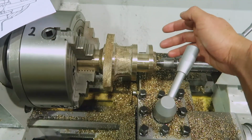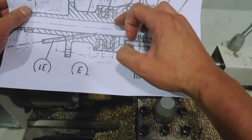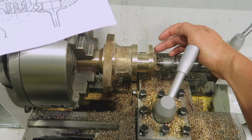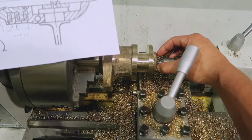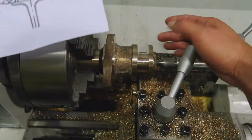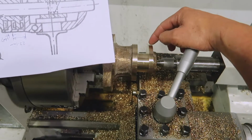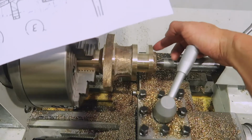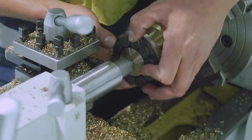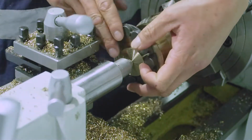And so now I need to machine this front section to accept that thrust bearing. So that needs to go down to 40 as well. That's 40 there. That'll go down to 40. And then most likely I need to machine off that thickness there and that thickness there down to 6 mil there and all the other dimensions. So let's go, and bang. Nice. That's one thrust bearing on.